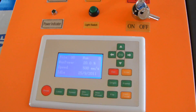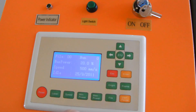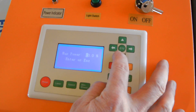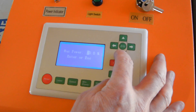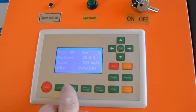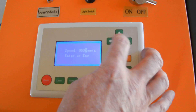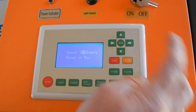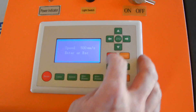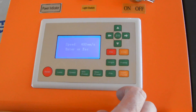This is a LCD display. The max power is set to 20% right now — you can adjust that right here, just click that and set it to whatever you want, then click enter when you're done. You can set the speed here — it's set to 500, which I think is as high as it goes. If you enter 600 or 700 it will just go back to 500. You can go down to 400 and it will stay at that, then enter it when done. The speed is now at 400.